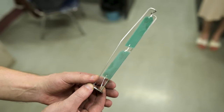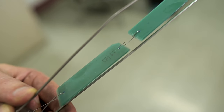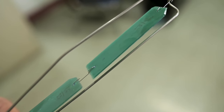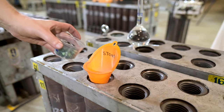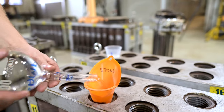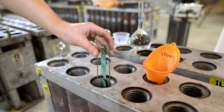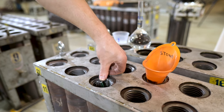Once the natural stone is prepared — meaning it's sliced into smaller pieces — we grow the seed out of it. Once we've prepared the seed, we need to attach it to a wire to put it inside the autoclave. Then we put the source material inside the autoclave, add a special solution to create an environment for growing, put the seed inside, and seal it.